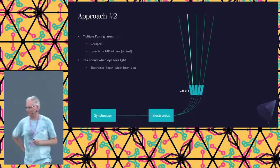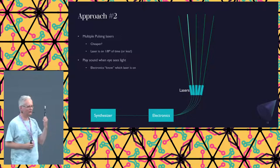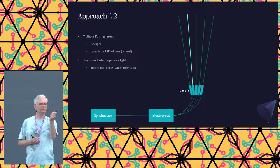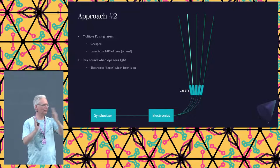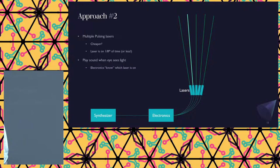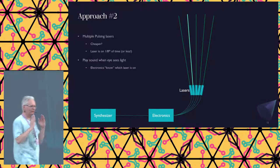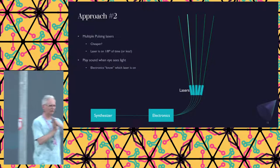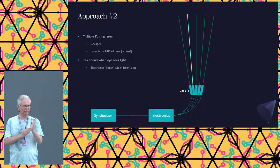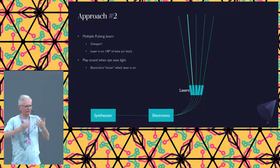So we bought several of these cheap lasers. And we decided, okay, let's do just this. So we take eight and we turn them on one at a time. There's one eeny tiny problem, and that is that at that point we're talking a 5 milliwatt laser that is on 1/8 of the time versus a 100 milliwatt or 200 milliwatt laser at the same time. So our laser would not compare in the light intensity